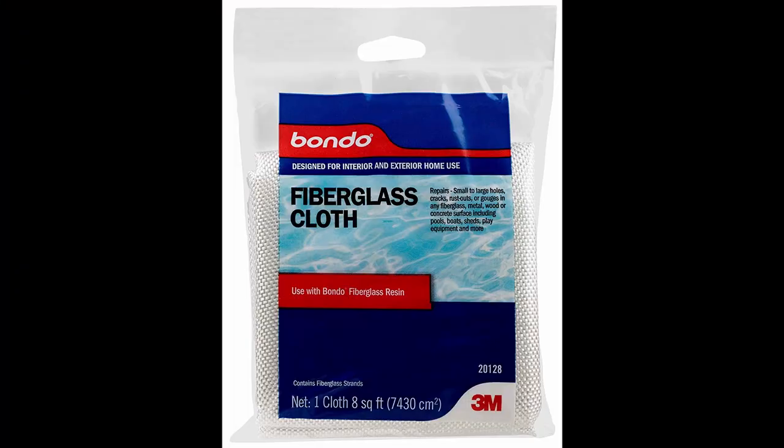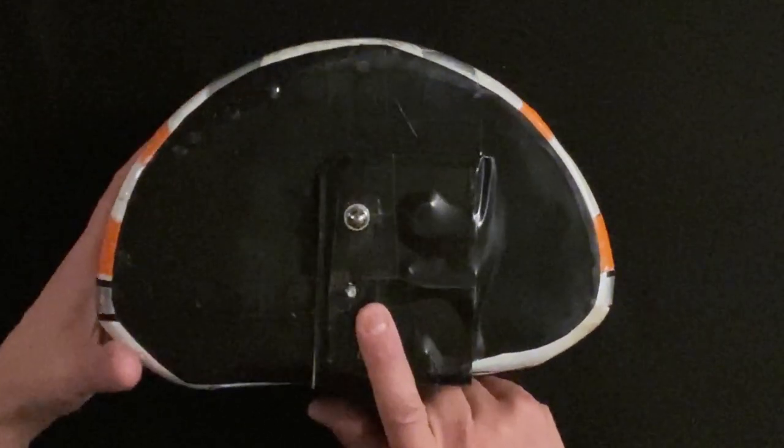I repeated the process of using fiberglass resin and added some patching mesh to cover the head to give it a nice, hard, rigid form. I cut chunks of fiberglass mesh in various sizes — 2-inch squares to 2-by-6-inch rectangles, plus some triangle shapes around the sensors — and used a disposable paintbrush to apply it. I used JB Weld to bond small flat brackets with bolts sticking through as mounting points to attach the heads to the wheelchair. I set the bracket at an intentional slight angle so the head leans back just slightly. I primed the head using the same automotive primer as the bases, then sprayed a base white coat.